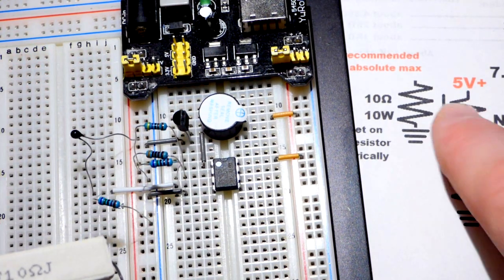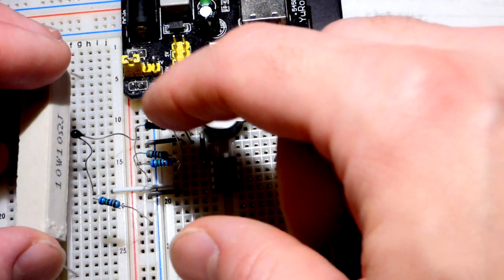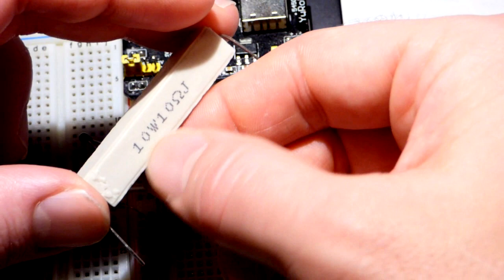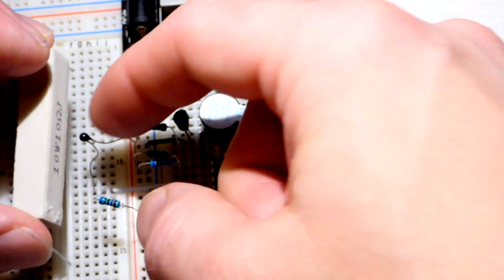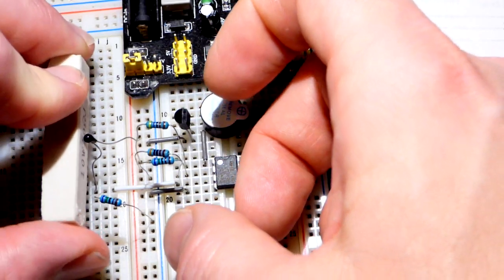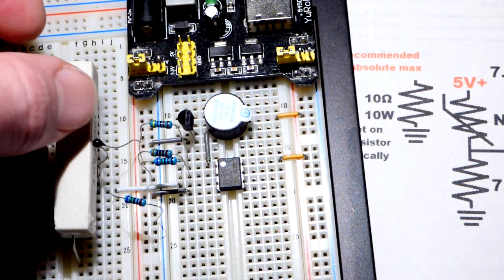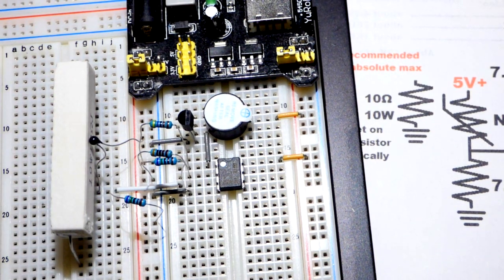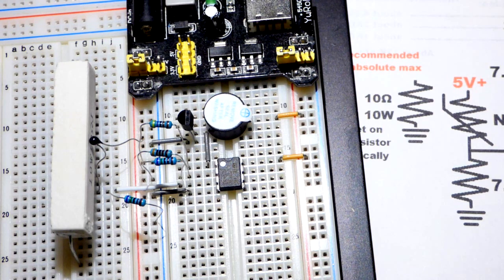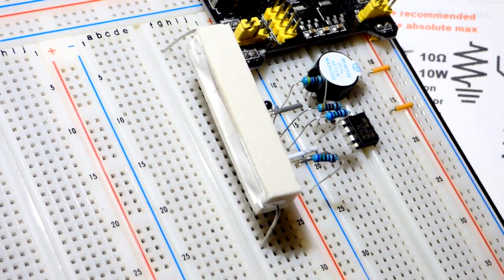Finally we're going to add the 10 watt cement resistor and set it next to the thermistor, though it is not electrically connected at all. I'm going to use a completely different power supply that I can vary. They nicely label this one '10 watt 10 ohm J' — I'm not sure what the J means exactly, check the datasheet. Placing it in two blank rows and pushing it up to the thermistor, just resting on the side of it.